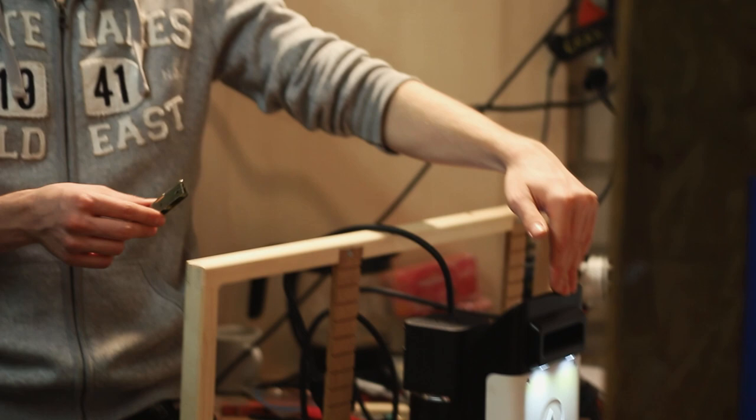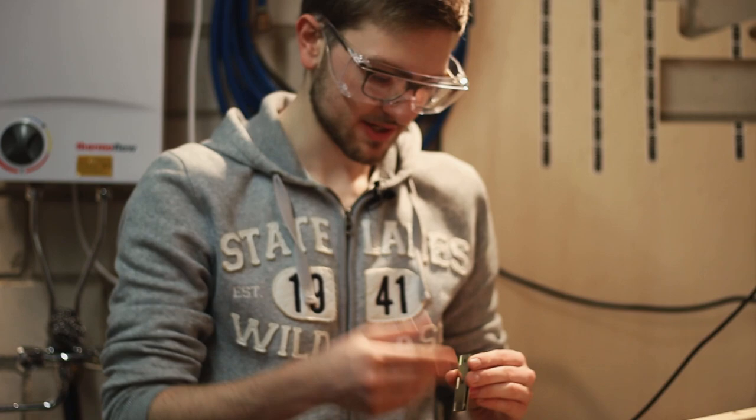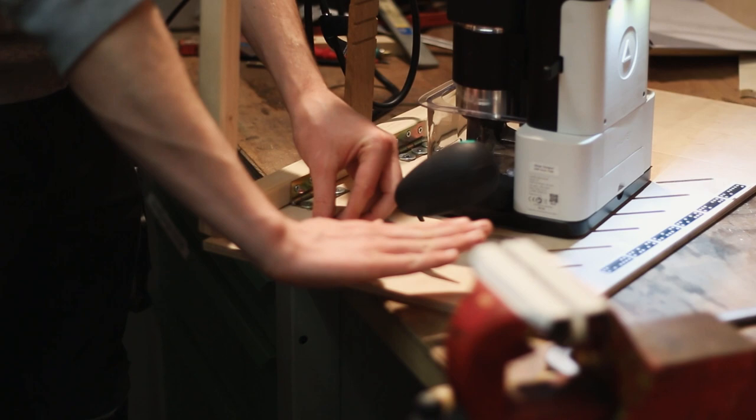What I'm trying to do now is to make the hinges flush with the backside of the laptop tray. So I'm going to use the Shaper Origin to just quick and dirty draw a rectangle to the pencil drawings that I've made on the wood. So just optically making that cut and make a 6mm offset where I can place the hinges, and hopefully they'll be perfectly aligned inside our piece of wood here.